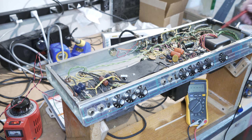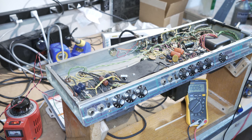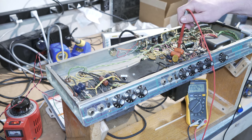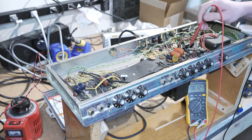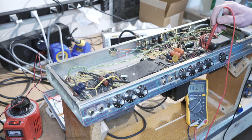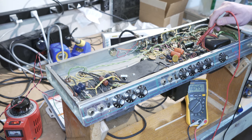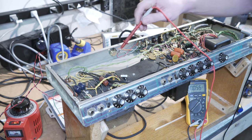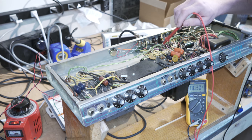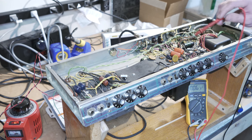Now, it's going to rectify this through the rectifying bridge there to 34 volts. So that's not enough to do anything, but I'm also knowing now that I'm safely pushing 34 volts across this right now. And I can check and see if anything is running at a specific voltage. -3.9, that's coming off of the, -4 volts coming off of the bias circuit, etc. So I'm just checking around, seeing that I get some voltages that make sense. 33 volts at the anode of that tube. On my heaters, I should have no AC volts, but okay.